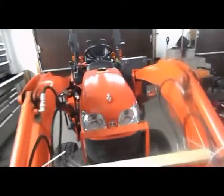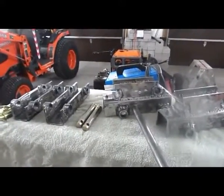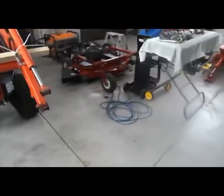align everything. I'm going to actually weld the pipe across these. It's going to grab somewhere near the top here, probably around here somewhere. I'm going to weld that across so that both units are connected. But I won't do that until I have them on the arm and I actually pick the bucket up. If there's any twisting, a small adjustment, a tiny adjustment makes a difference.